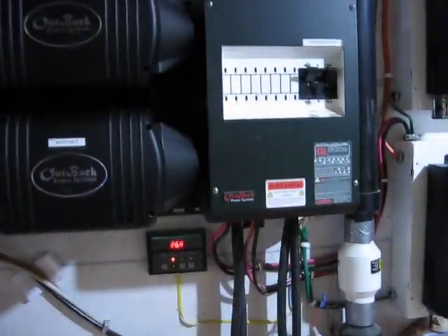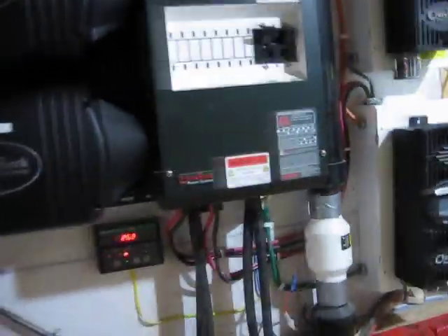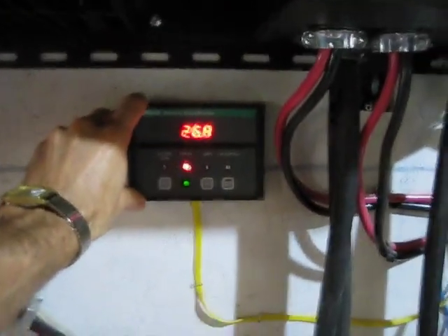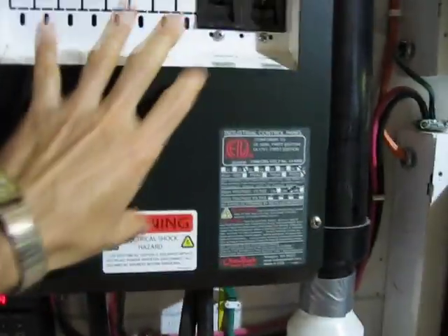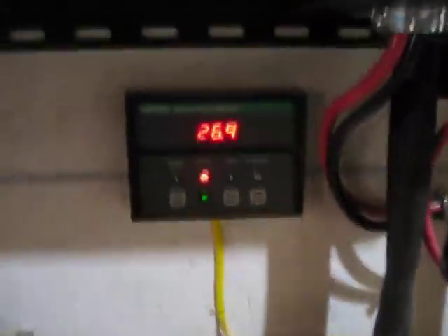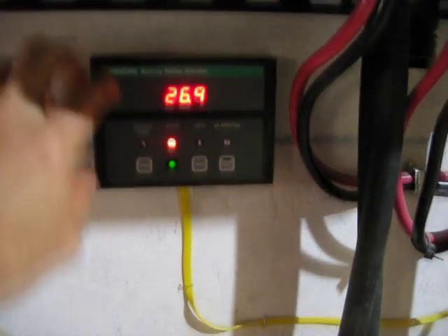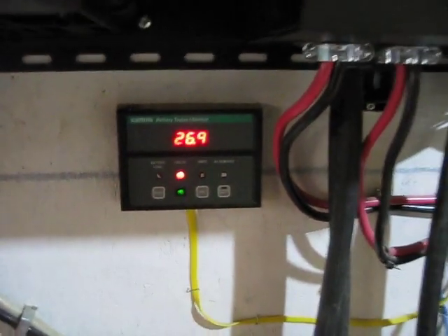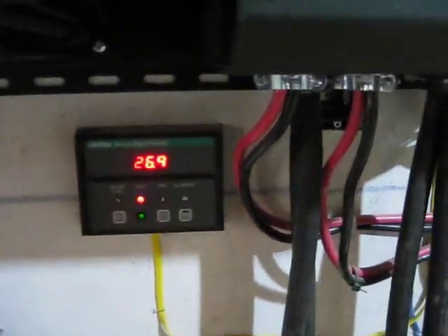It's also a big, big battery bank, so if there's a short in there the cables have to be able to handle it. The disconnect switches here will trip 250 amp breakers — you're probably used to 15 amp breakers in your house. There's also some monitoring equipment right here: a Xantrex battery status monitor connected to a little circuit attached to a shunt on these cables. That monitors the batteries — the flow of electricity going in and out — and represents it as voltage, current, accumulated charge, and so on. It gives you a fairly accurate idea of your battery voltage, which is currently 26.9 volts for the whole bank.